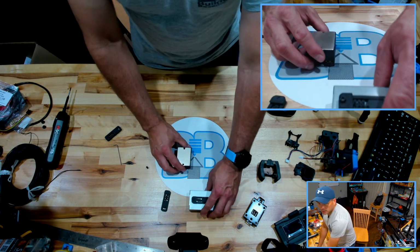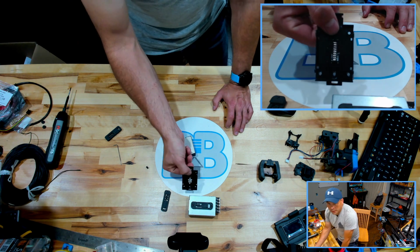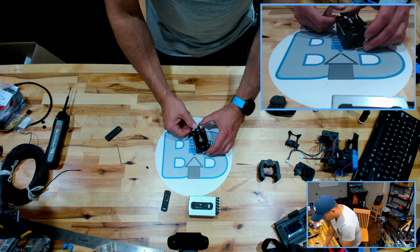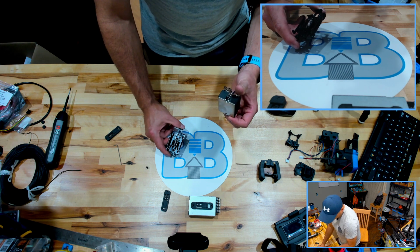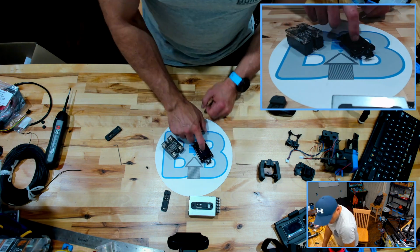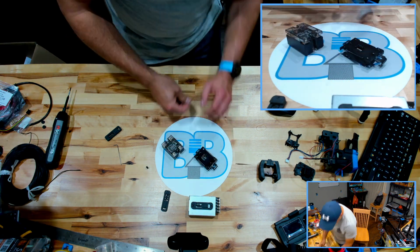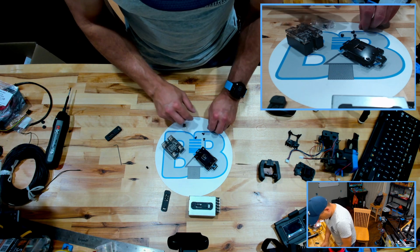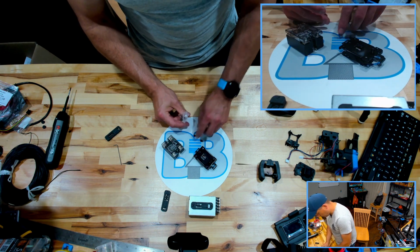While we're waiting for that, we have our solid state relay, our SSR, and the FORMBOT kit did come with this mount. It's a little bit different looking, but very hefty, very nice, or at least I think it's nice. It's going to get mounted much the same way everything else has. So is that threaded? Yeah, okay, the black mounting bracket is threaded. I just don't know what size screw that is. We'll see if it's an M3 real quick. Looks a little biggish for an M3. Nope, it's not an M3. Maybe it's an M4. That looks a little more appropriate. Let's see. It is an M4. Okay, so we'll use two M4 screws to mount that.